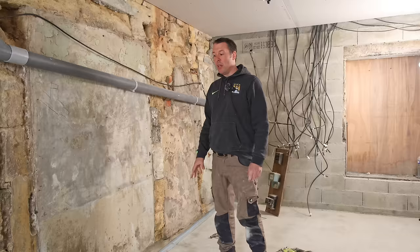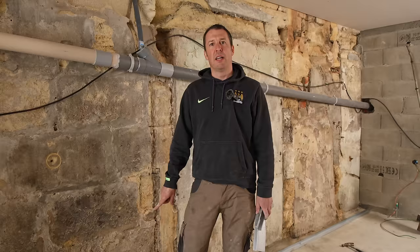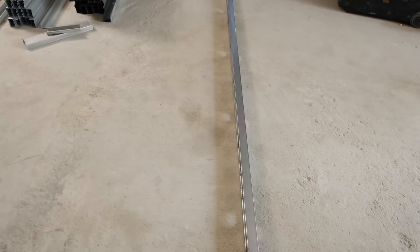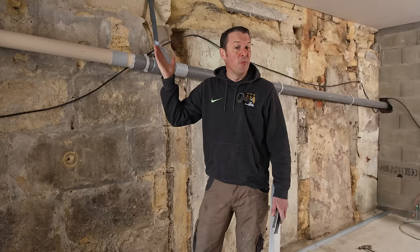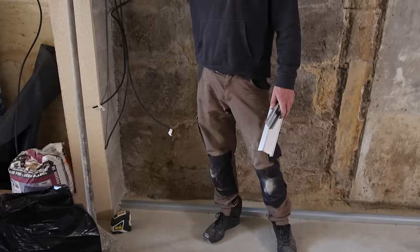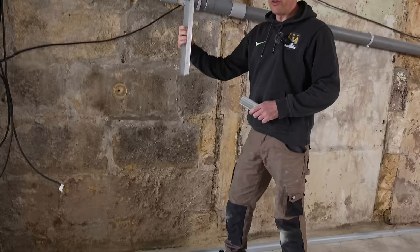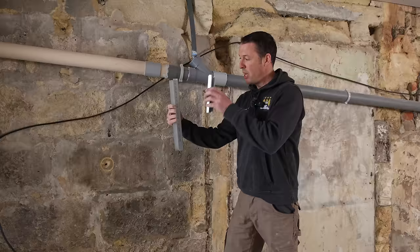So Anna, how wide is a plasterboard? 2-3 meters. That's the length. Yeah. The width? I don't know. Plasterboard is always 1.20 meters wide, yeah? Yeah. And the montant, to support the kind of, you don't want any movement basically in your plasterboard. So you always start with a montant here, so you can screw the plasterboard to it. Like a vertical rail, we'll say. And then when the plasterboard ends, which is 1.20 meters, you want one to screw that piece to, one vertical rail, and then another one to start your next piece of plasterboard.